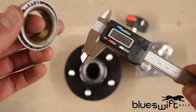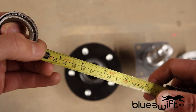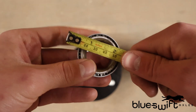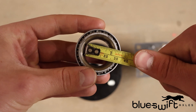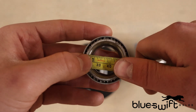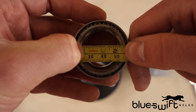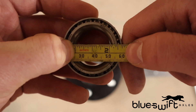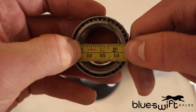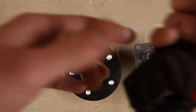Now, if you do not have access to a digital caliper, a tape measure can also be used to find the inner diameter. When using a tape measure, there are some specific rules you want to follow in order to get the accurate measurement. You won't want to start by pressing the front of the tape to it or trying to hold it above it — you'll want to start with the first inch. Line up the first inch on the wall of the inner bearing and refer over to the other side, eyeballing both sides as best as you can. Here you can see we are getting 1 and 1/16th of an inch, which equals out to 1.062, which is what we were getting on the digital caliper.